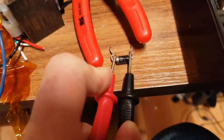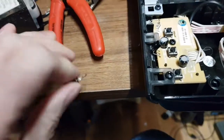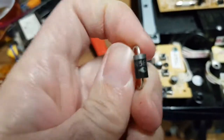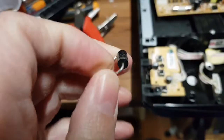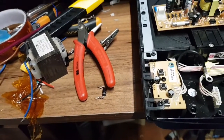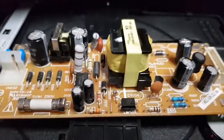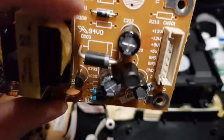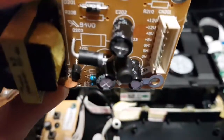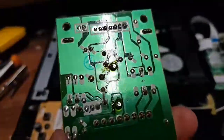The diode has been removed from the circuit and measures zero ohms even in the wrong polarity — it is kaput. We need a new diode. It's a 1N5822. I happen to have found the exact same diode in my little box, so let's whack it in. The new diode is installed — off the board because it gets really hot under stress, which is why the original one exploded and didn't last long. Ten pounds — there you go.